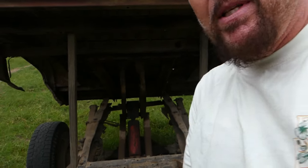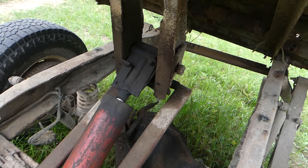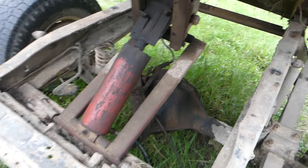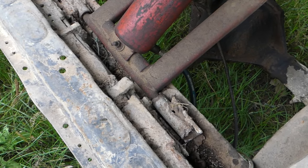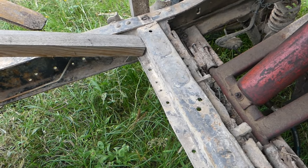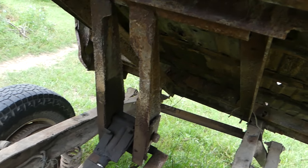You can always tell when a guy's serious about working on something greasy when he wears all white. So everything in here is old farmer Bill — I'm in trouble right away. I took a look at those welds; the way they made those pins not fall out, they just took a stick welder and welded a bunch of crap on the end of the rods. Those bolts in there aren't actually holding anything — they were stuck in there and then welded. No grease anywhere, no grease zerks anywhere. I might drill and tap and put some grease zerks in there.